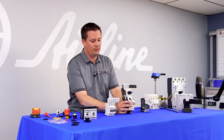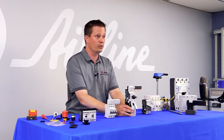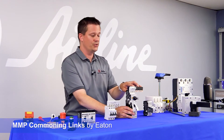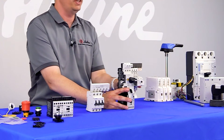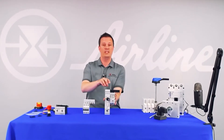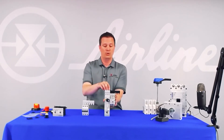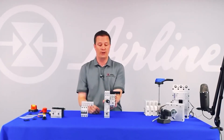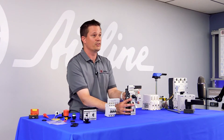The first and very simple solution for saving time in a control panel, especially when wiring up multiple pieces of motor control, is the use of commoning links. A commoning link is a simple miniature bus bar system that allows you to take multiples of a similar type of product — in this case, two MMPs — and common them together with a bus bar. Rather than requiring single or three phase power into the line side of each individual unit, you can bring your line feed into the first one and the bus bar will feed the line signal to the rest. This will save a significant amount of time, especially in a panel with 76 motors to be controlled.